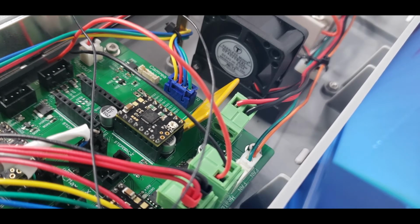So for me, the Z motor, the stepper motor for the extruder are different, and then the X and Y motors are different as well. They're like 3 sets, 3 different values that I have on mine. Of course, this will vary by your printer, so the best accurate way to do this is to actually look up your models of your motors and get that data sheet.